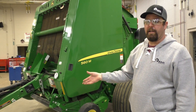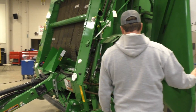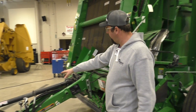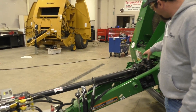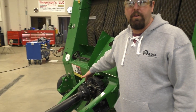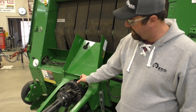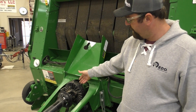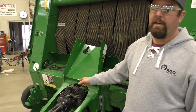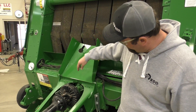We'll highlight that when we look at the monitor. Starting off, we open the door. Here we got our main things coming in — our PTO coming in, our slip clutch. We are measuring our slip clutch because we need to know; we're going to alert that operator if we start actually slipping. The old ones actually had discs that you could tighten up. This one still has the discs but it's going to be spring tensioned — you cannot adjust that. So if you basically wear out your discs, you're going to have to buy a new one.